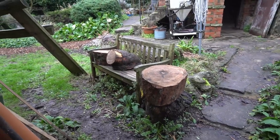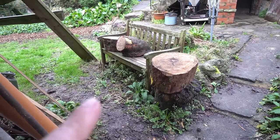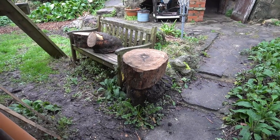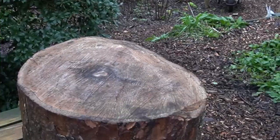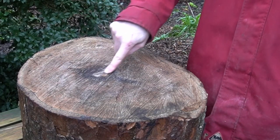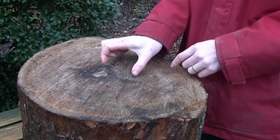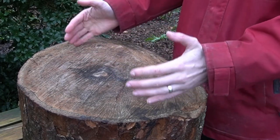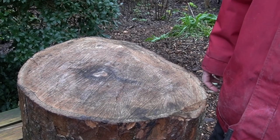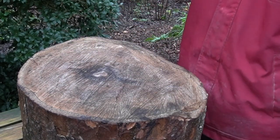This is the wood I had in mind - I've got two full rounds and a crotch piece, and we're going to prepare them for the lathe. The crotch probably won't get done like the other two, but we're going to try and get some proper bowl blanks out of these. There's a little check mark starting to appear in the pith, so we're going to cut a strip out of the middle so we can get some little tiny dishes from that, then two sides giving four bowls. My lathe can do about eight inch turning and it'll probably shrink a little when it dries.